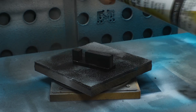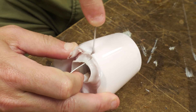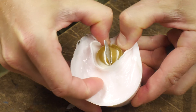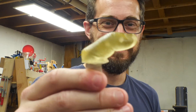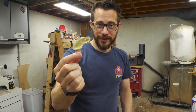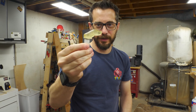After that, it was time to go check on the finger. If you want to use molds again and again, you need to cut them in the right way so that you can put them back together in a container and it won't leak out the resin. I cut this in the shape of an S so that it would fit right back together in the cup if I needed to pour another finger. Luckily, this one worked out fine. That is a little disturbing, but also really cool — it did a really good job. It's at the perfect 90-degree angle to be able to push the button. It worked out pretty well, it's just kind of unsettling to look at.